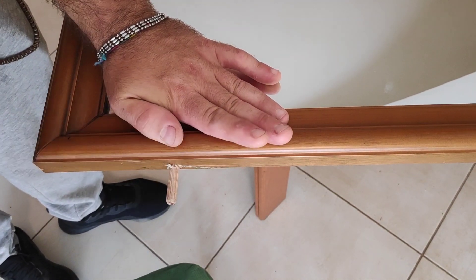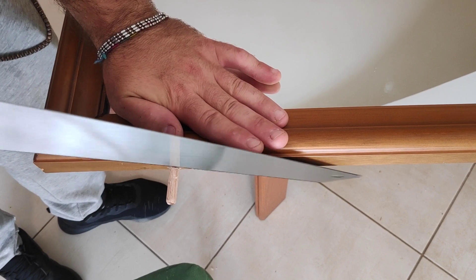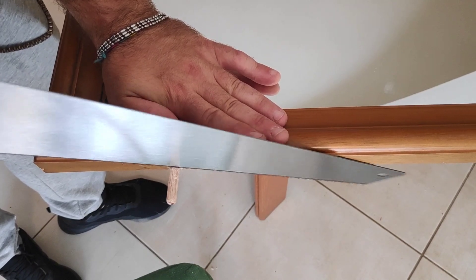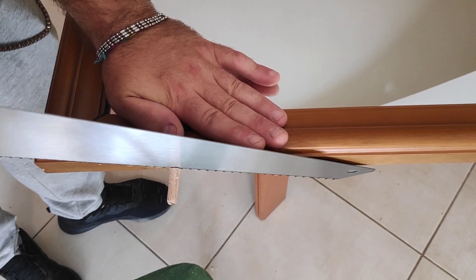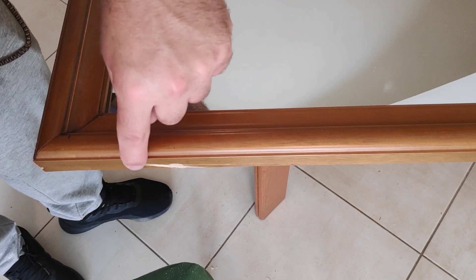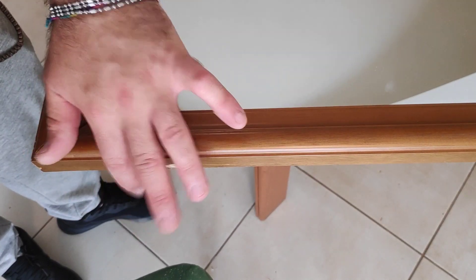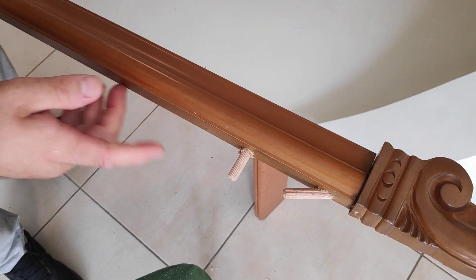As you can see some of the glue is making a little mess, but it's dry enough so we can cut this little dowel away. Then we can use some filler to clean the situation up, and then we can sand it and paint it. There is no more hole. We're going to sand it a little bit — it's going to get smooth and perfect. It's going to be painted so no big deal even if it gets a little messy.